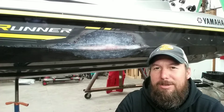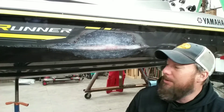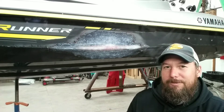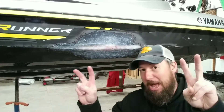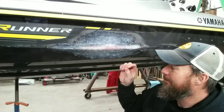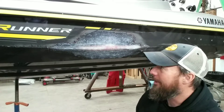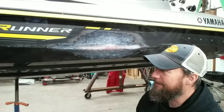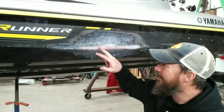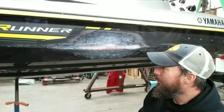It's now six hours since we laid up the side of the boat. It's six o'clock right now, so around four o'clock I set up a little space heater to blow heat on it — that's not uncommon to do. I checked the temperature and it was at 24 degrees Celsius. I left it for 20 minutes, came back and it was at 30 degrees. It started to run and got boogery on me basically.